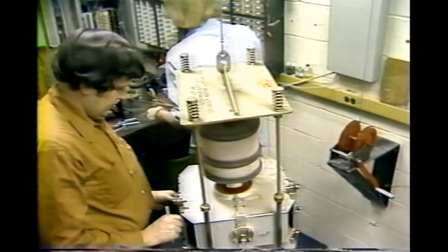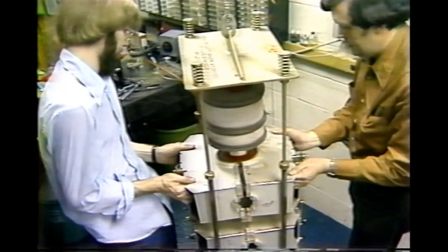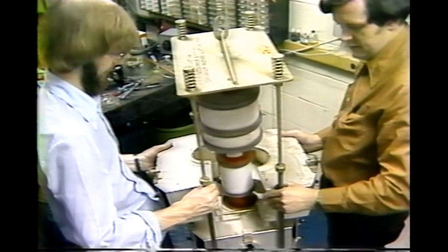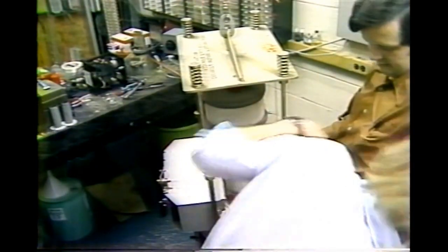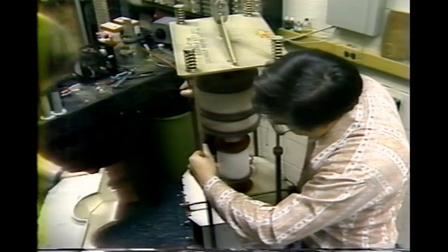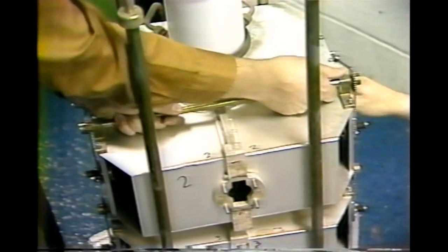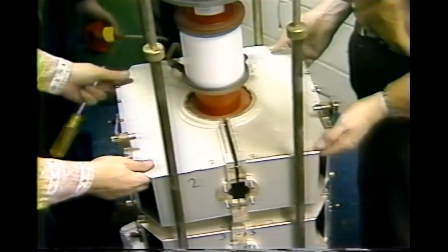The tuning doors on opposite sides of each cavity are connected by a spring-loaded shaft. We merely compress those to move them. Loosen the allen head screws connecting the cavities together and remove the cavities one by one. A little spreading of the brass bars supporting the assembly is helpful here to clear the halves of the cavity. We place aside the first cavity, being sure to number all parts so that they may be assembled exactly as they were disassembled.